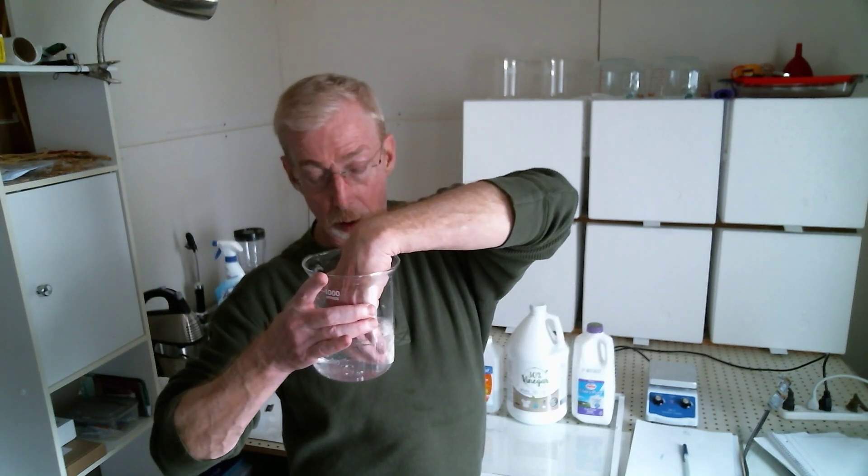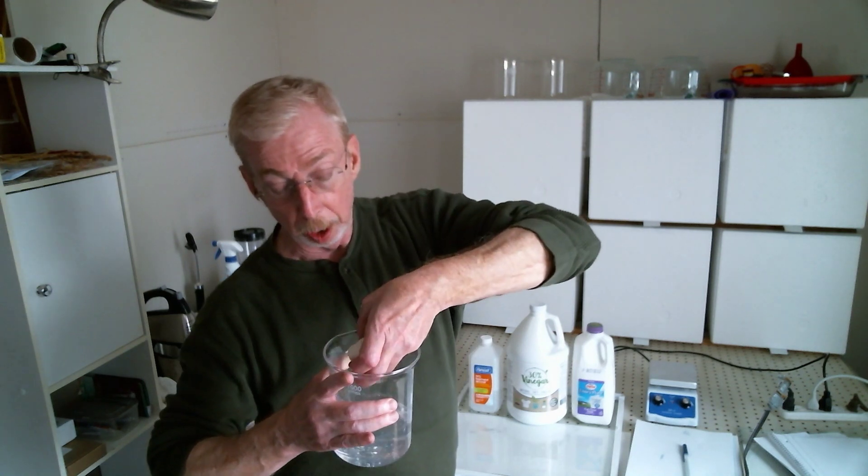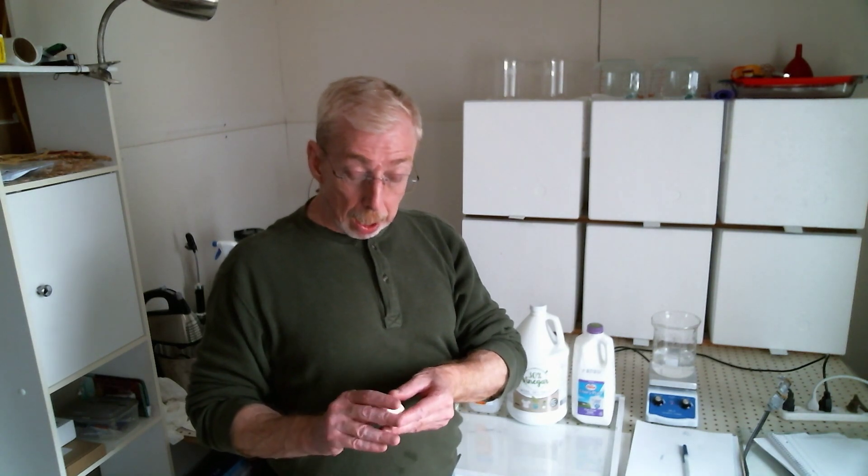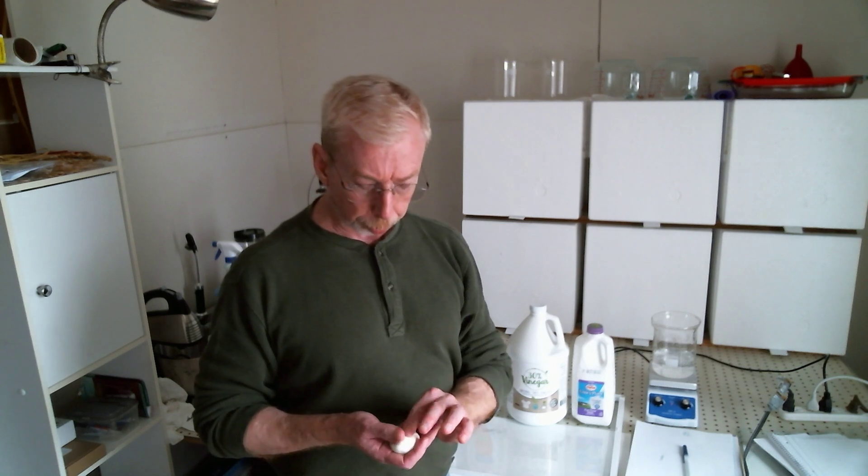I've continued to rinse this — the water is very clear — and as you can see now we have a very rubbery, solid, stretchy casein. It can be molded into any shape you want. It's going to take a few days to dry. Afterwards it will be dry, but it's not yet water-insoluble and it's not Galalith yet. The original patent used formaldehyde to form cross-links. There are green alternatives to that which I can put in the links. What I'm going to do personally is use a very natural substance such as shellac to spray over it just to protect it from water.